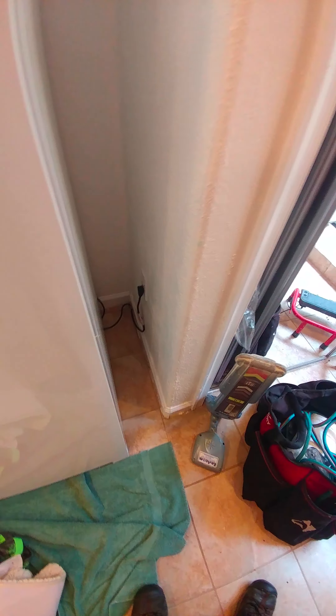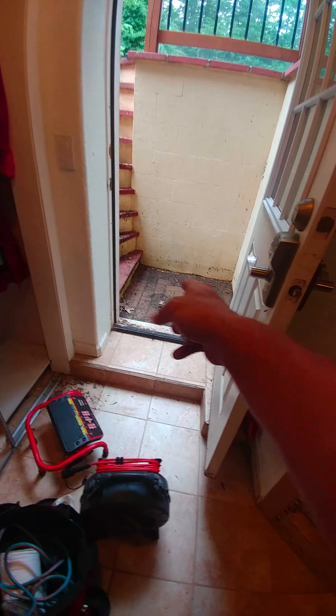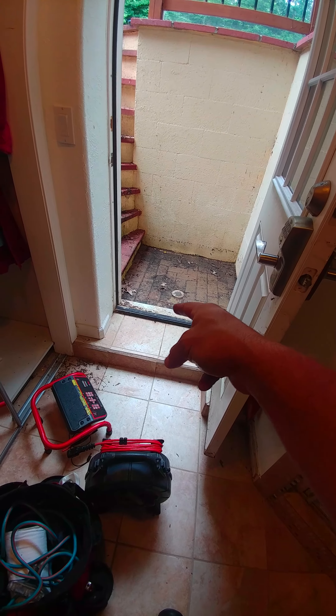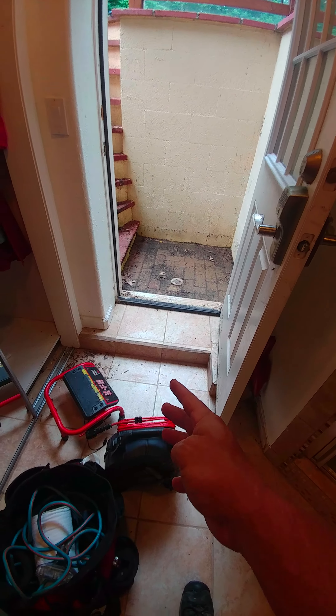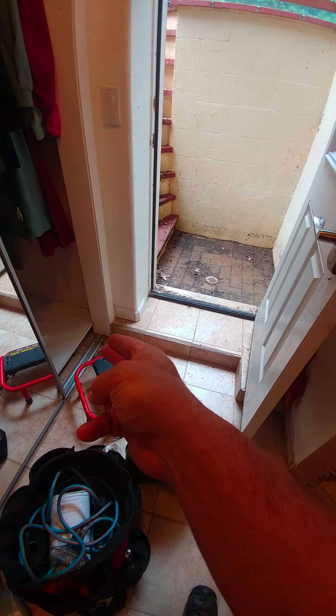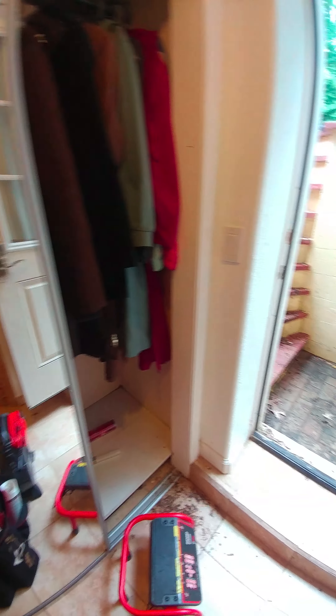So what I want to do for her is drill a hole through the wall and plug the sump pump in over here — battery backup sump pump, new sump pump pit, new drain line. I want to put one of those rectangle trench drains right here. You can have a drain in the middle or a drain on the side. We don't put tile back, so we bring it over to the sump pump pit right there, then run the discharge line up to the drywall and outside.